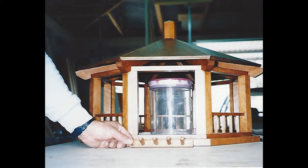And then there's the plywood. Again, the plywood has a little bit of a challenge to it because you're dealing with compound angles. You have the slope of the roof. You have the eight-sided angle. It's got to be cut vertical. And yet, you have the post at the top as the point because the two flat parts are where the rafters are. So at the top, it's got to be cut snug there, which I did. And you've got eight sides like that. So had little particularities here and there.